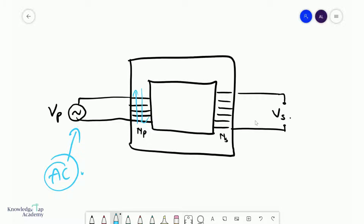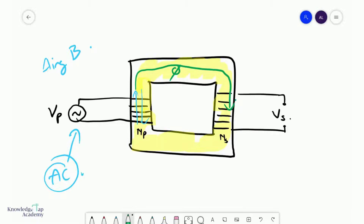The important thing is that it's a changing magnetic field. The transformer is typically made up of something like iron, which is a good ferrous material. This magnetic field inside gets transported to the other side, because the magnetic flux created in this iron core is transferred effectively by something ferrous like iron.